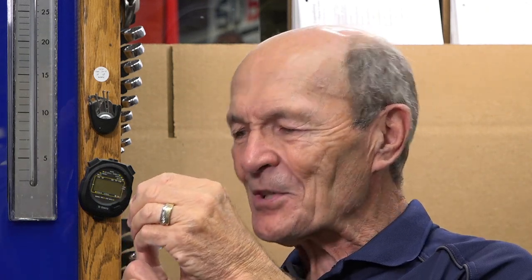When you take out an old burst disc, you can see how that flat brass disc is no longer flat. When you put it into a tank and fill it with air for the first time, the pressure actually dimples the brass — it's trying to push out. The burst disc is actually dimpled and weakened a little bit on the first fill and on every fill after that. So yes, change it every year with your visual, or at the very least every couple of years — and for certain on your hydro date every five years. It's not expensive: about $20–$25 for a brand new burst disc installed.